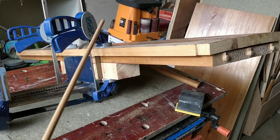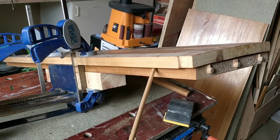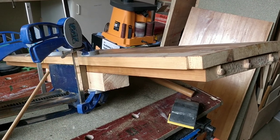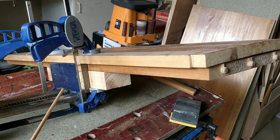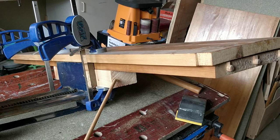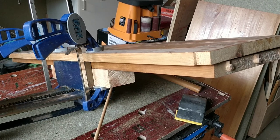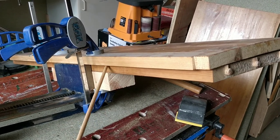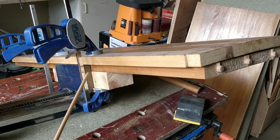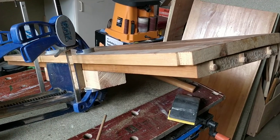So this is how I'm going to mount it. This board is slightly longer or deeper so I'm going to have a little recess here, and that recess will accommodate the back of the metal jaw so I can put wood on the front and not have any metal showing. There's then a bit of 3x2 flush with this piece to give it some extra strength, and it gets bolted underneath onto the 3x2. My plan is to glue these two pieces together, glue a bit of 3x2 onto this piece, and then screw it all in.